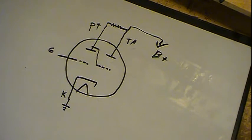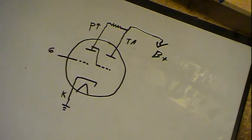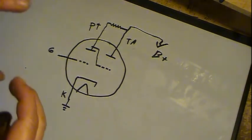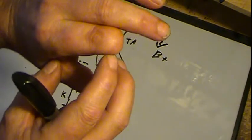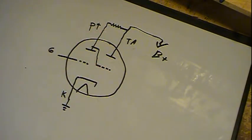One of the two. And generally when you've got a problem that the eye tube doesn't seem to be working as well, or is not as bright, the culprit is usually that resistor has floated out of tolerance. It's gone up in value. They're generally located in the socket that plugs onto the eye tube, and that's where you have to go to change it out. But that's usually your culprit right there. That's basically the connections that are made.